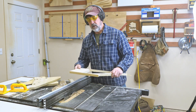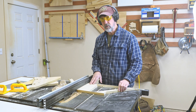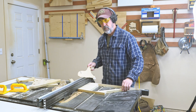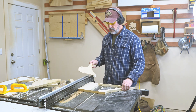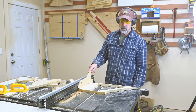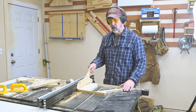If you're ever making a cross cut on a table saw like I'm doing here, it's wider this way than it is this way, so you have to be careful as you guide it through the fence. Don't put any pressure on this to push it up against the fence and the back of the blade — you'll get kicked back. What I like to do is just use this as my main guide. My hand may be over here, but I'm only guiding it along; I'm not putting any pressure at all on it.